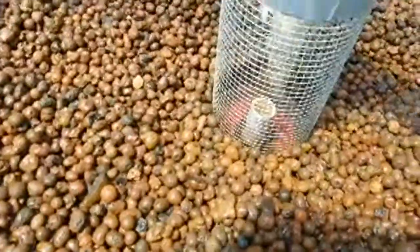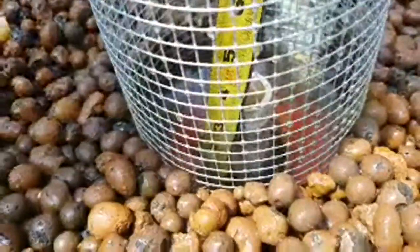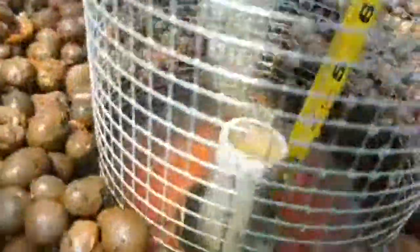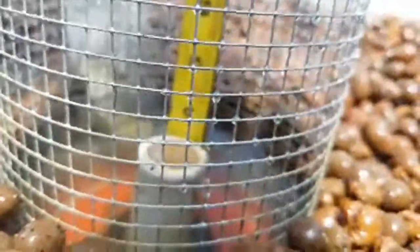So we pull this out, and we see that it was lower than the standpipe. And this has got to be fairly precise, from the uniseal, from the black. Okay. So it's a little bit like 3, yeah, 3 and not a half, 3 1/4. Well, we can pull it and see, because now we're not going to get any draining.